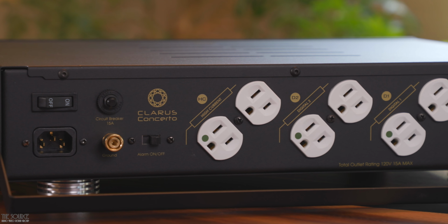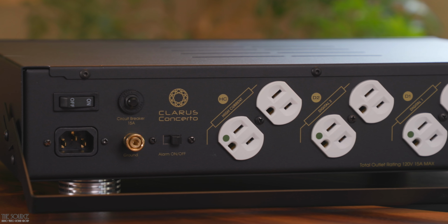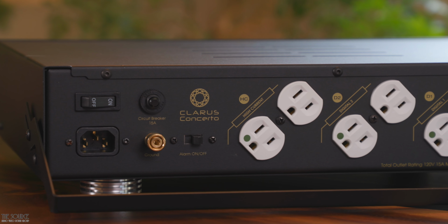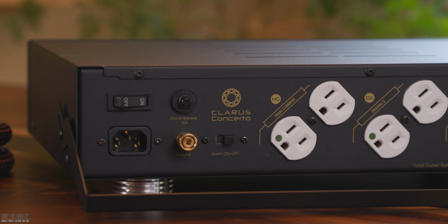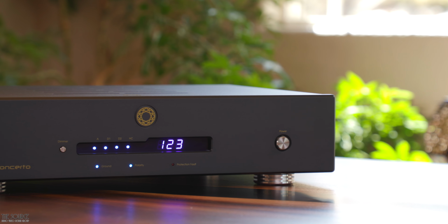Clarus C-Core technology is used in all the analog and high current filters, allowing for significantly reduced audible noise when voltage and current are applied to the core. Clarus also uses vibration control by using vibration dampening material to prevent low frequency AC signals from passing through the copper windings of an inductive filter, preventing mechanical vibration.